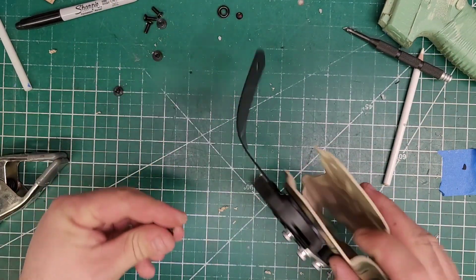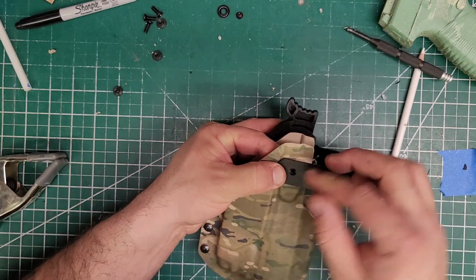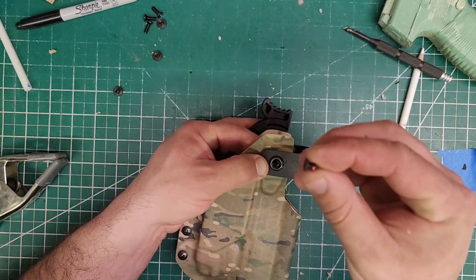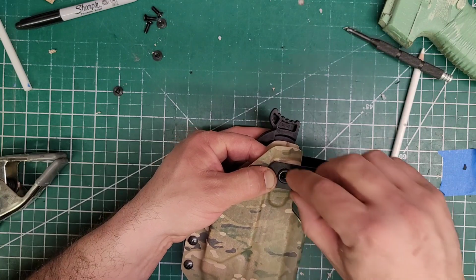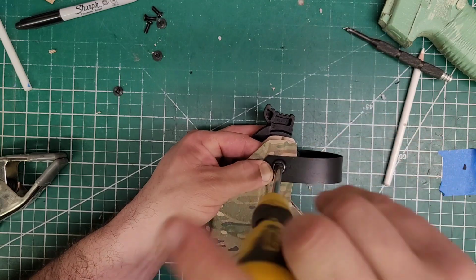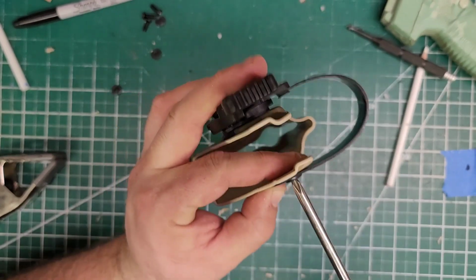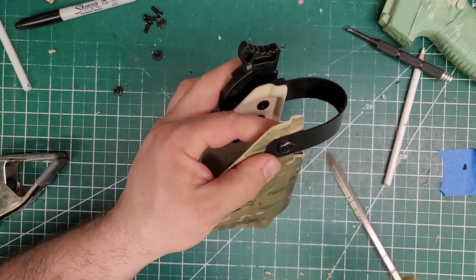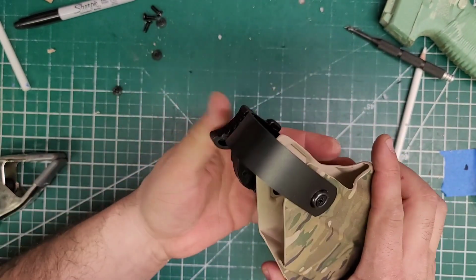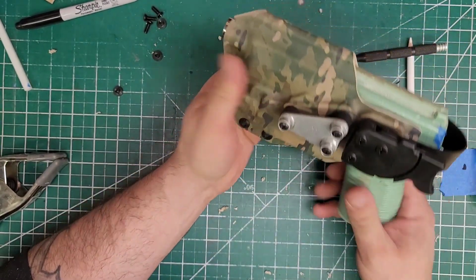And this particular setup, there's no washer. It's just nut, then the hood. And what happens is you're using this right here, but if you notice, the bolt is tapered, and what it does is it actually bottoms out against the slotted post before it even contacts the plastic hood. So if you notice, it's spinning and the hood still has play. So that's tied up as far as it can go. And there we go. So we'll take this, lock that in, bam.